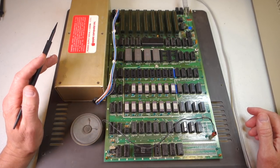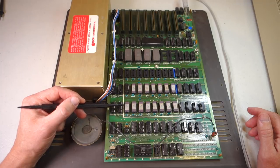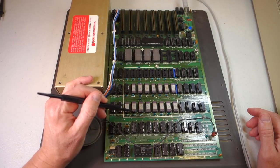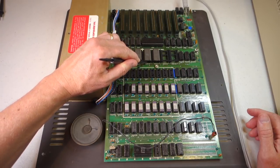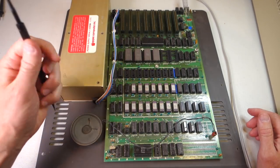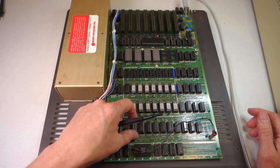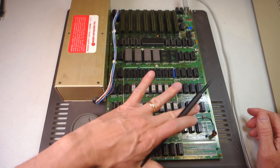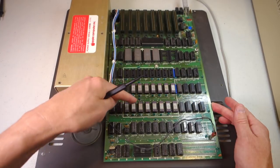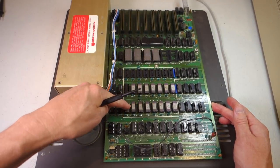If you don't see anything obvious, it's time to dig a little deeper. Look for chips that are not in their sockets in the correct direction — on this board all of the chips have their notch pointed in the downward direction, as indicated by the silk screen. Also, with a lot of these older boards, thermal expansion from turning them on and off causes chips to slowly become unseated and make a bad connection. One easy fix is to just go through and press down on all of the chips to make sure they're all seated properly — you can actually hear some of these weren't properly seated, and just pressing down can fix a lot of problems.